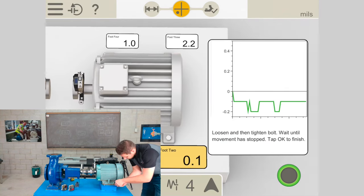I want to verify I'm getting the same numbers, so I'll repeat the procedure using Easy Turn again to confirm repeatability. The numbers are very repeatable — in the vertical plane offset I have 10.4 and 10.7, just three tenths of a thou difference, and the rest are very close as well with about four tenths difference in the horizontal plane. If you weren't getting repeatable numbers, there would be some other issue on the machine — coupling strain, bearing play, a twisted base, or similar problems.